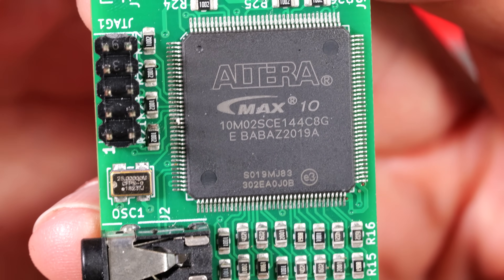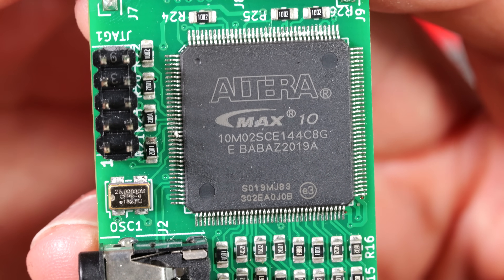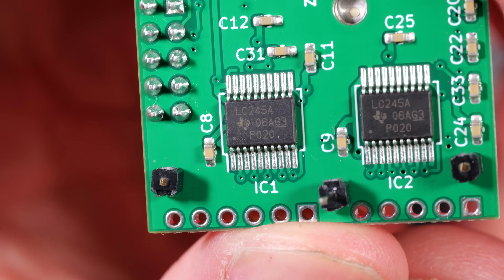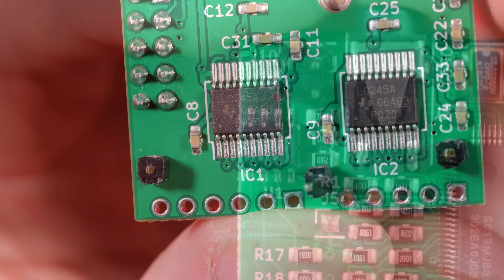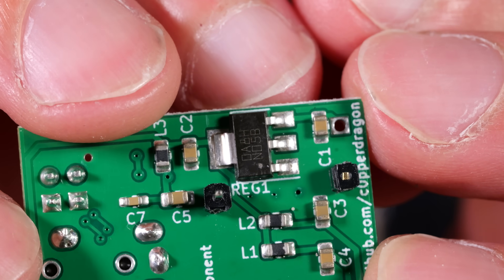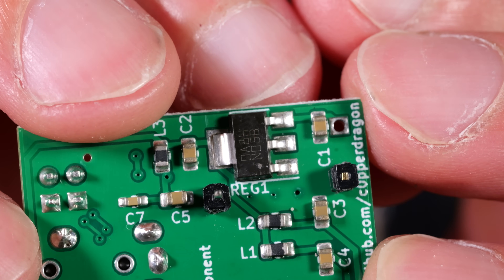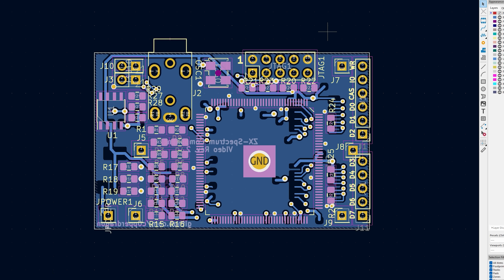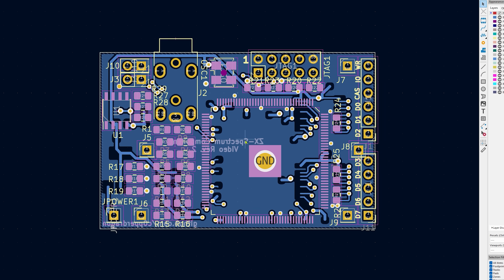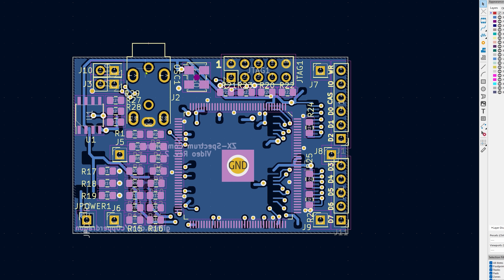Here's a close-up of this chip — that bit on the left is just fluff, not a short, so don't panic. On the other side of the board we have two level-shifting transceiver chips, because the board runs on 3.3V logic levels and the ZX Spectrum works on 5V. Another chip produces the video signals that go off to the monitor, and a voltage regulator supplies the 3.3V. There is a comprehensive GitHub for this — link in the description — where you can get all the KiCad project files, view the schematic, generate Gerbers, and have them manufactured.